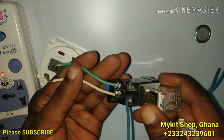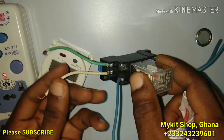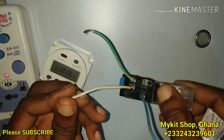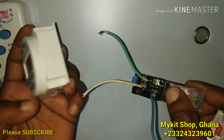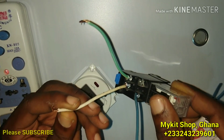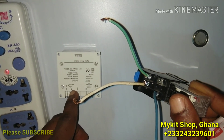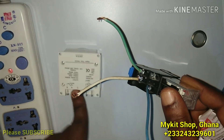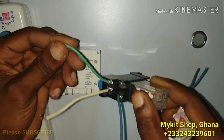Neutral and live — when you plug this in, it's going to get power to shift the terminal. We don't want this to be on always, so we are going to connect this to neutral, and then instead of going straight to live, it's going to connect to the timer. The timer will control when to give the live to this relay. So instead of you doing on and off manually, the timer will do the on and off.